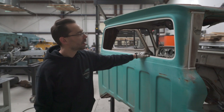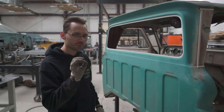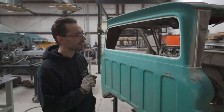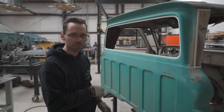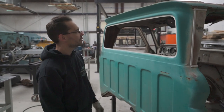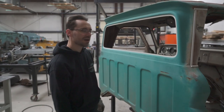So with the TIG, the heat is a lot more controllable, especially if you have some really small holes for the plug weld instead of some giant ones. You know, we'll probably have like a 3/16 hole for our plug welds. So I think we'll be okay. That'll make a nice solid foundation for the back window. So let's test fit it and see how it fits.